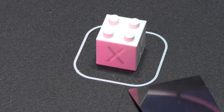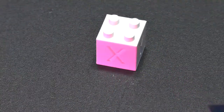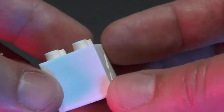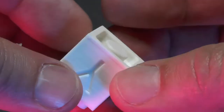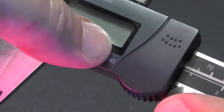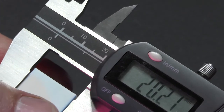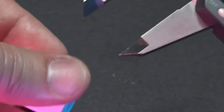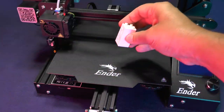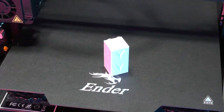Let's take out the skirt and pull the cube out. The printer is over extruding just a little bit, but this is to be expected. It is recommended to under extrude just a little bit when printing small objects like this, and we can do this kind of fine-tuning inside the slicer software. Let's pick up the caliper again and measure the cube. The last time I printed this cube it was a little short — let's see how it measures now. Very good, it's much more precise. Our printer extruder has now become much more predictable after adjusting the E-steps. In a future video, we are going to talk about fine-tuning the extrusion inside of the Cura slicer.